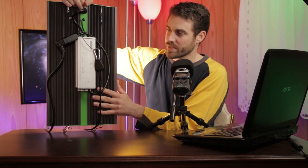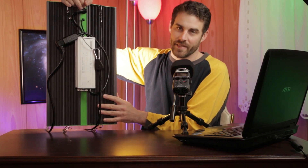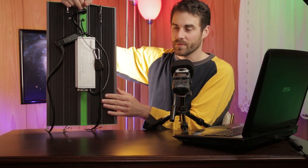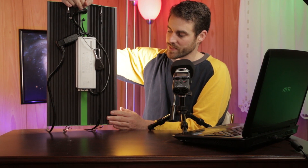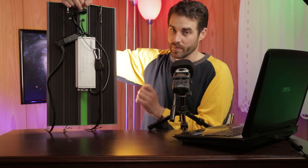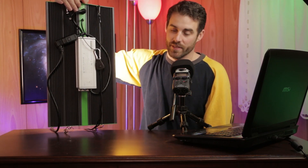It's a little weighty — about three to five pounds — because it has heat sinks on it, so it gets just a little bit warm. You can see the fins are painted a dark gray color. Some lights leave the metal shiny or white, but that's actually less efficient for cooling. It's better to have it dark because of black body radiation — when something is painted black it radiates heat better than if it were shiny or white. It's a fanless design, which is where a lot of lights are going as efficiency improves.